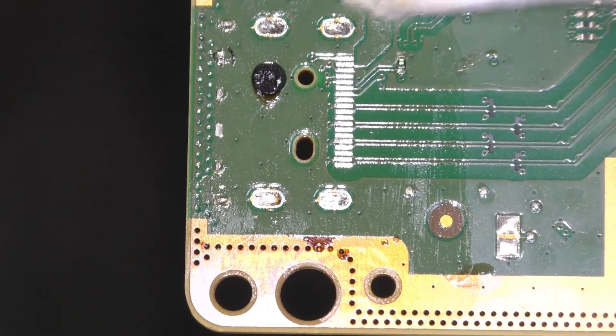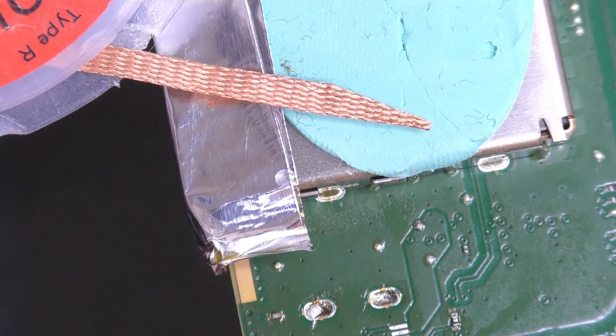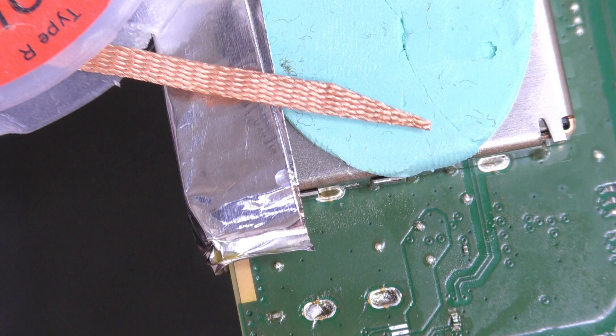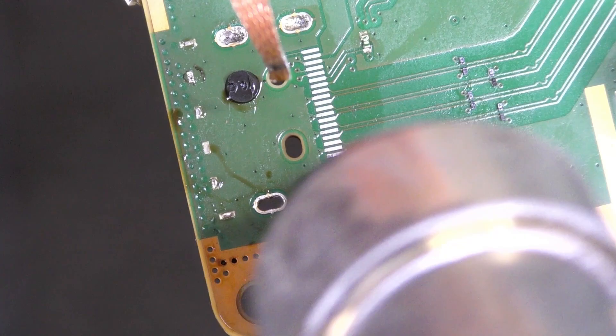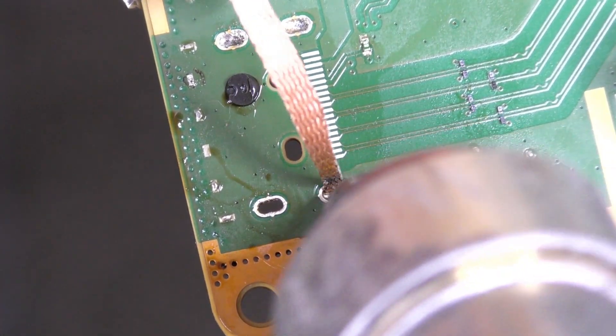It's quick and fairly easy once you've got the knack. First, apply plenty of flux and add some leaded solder to the locating holes as we did earlier before removing the old port. Clean away what you can with the wick, but chances are you're still going to have some solder in these holes. Get some scissors and cut a slant across the edge of your braid — it effectively forms a wedge shape in the end of the braid. Make sure the very end is just about small enough to enter the locating hole on the PCB. Next, add flux and get heating with your heat gun, focusing the heat onto the hole that you're clearing.